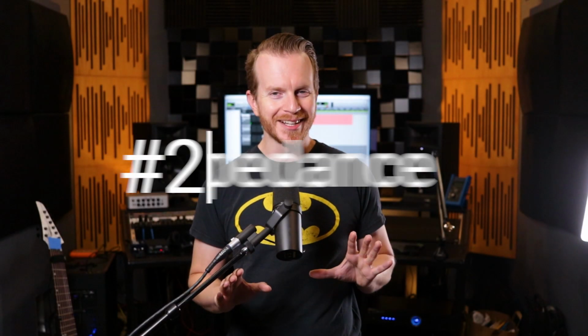Number two, impedance. Okay, so we're going to get a little bit into the weeds with this one, but I feel like this is an important point to mention. In the last point, I briefly mentioned high impedance and low impedance, and what I want to take a second to do is explain what it is, but more importantly, what you should be looking for in the specs of your interfaces and DI boxes. So what is electrical impedance? Electrical impedance is the measure of the opposition that a circuit presents to a current when voltage is applied.